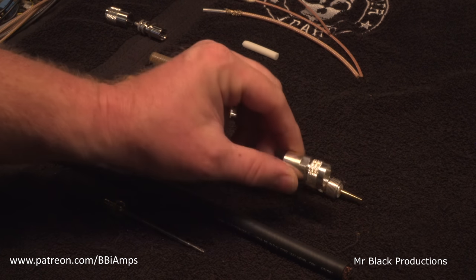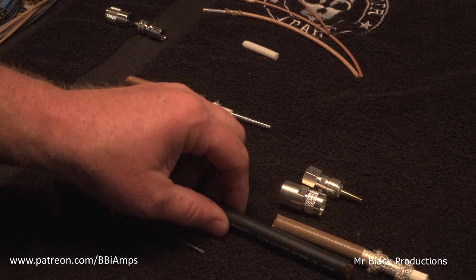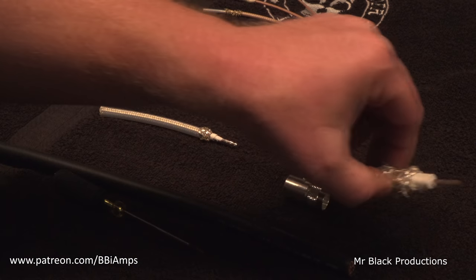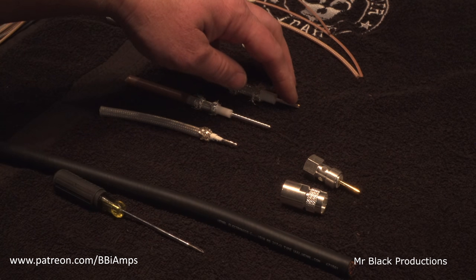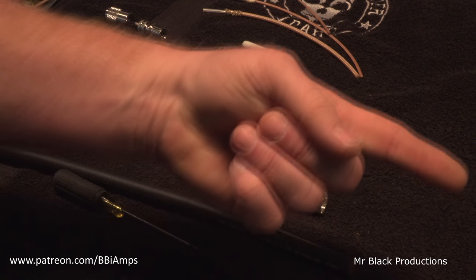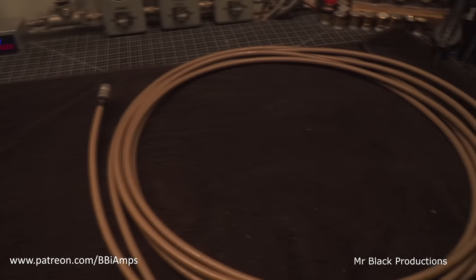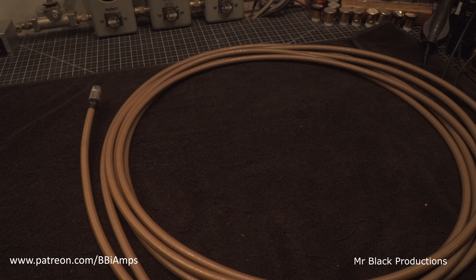The reason I needed this connector is because this coax is exactly the same size as 217, so I know this fitting will fit onto here. The center conductor, on the other hand, is a little carried away — 393 barely makes it. Like I said, you've got to cut three or four strands off. I will sacrifice three or four strands at the connector for the overall bigger stranded conductor going from A to B — from connector to antenna. My friend Zane saw it from across the room, zipped over, and immediately bought it. He got a screaming deal on it.